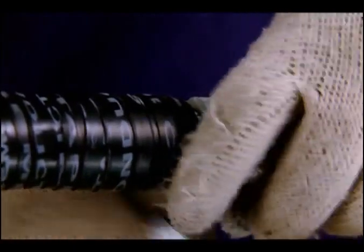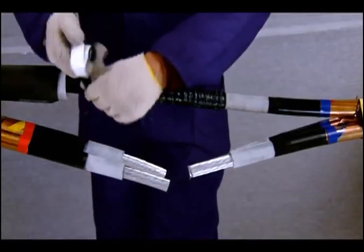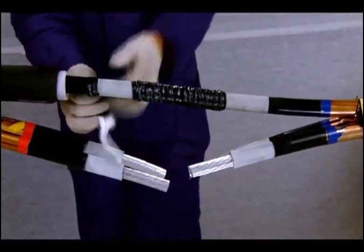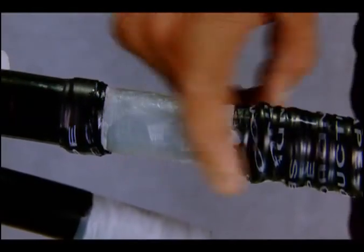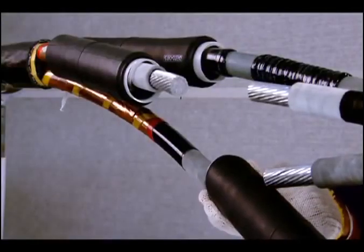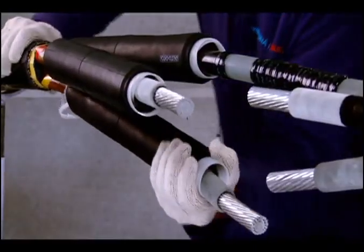Remove the release paper from the semiconducting tape and wrap it around the ferrule. Do not use too much of this filler — the final diameter should be only slightly greater than the ferrule diameter. Apply semiconducting tape at the cut end of the insulation screen, ensuring that it overlaps 5 mm on semiconducting and 10 mm on the XLPE insulation. Apply silicone grease on the XLPE insulation and stress control mastic — do not use this grease in excess. Insert the cold shrinkable sleeves on the other cores of the left side cable and repeat the process.